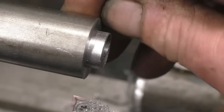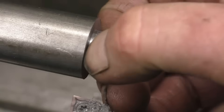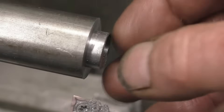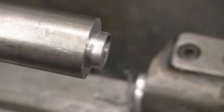So now we've got a nice finish on there and that's down to size. We've machined to the shoulder. Now there is a very very slight radius in there — sometimes you don't want the radius in there, so you put a parting tool in and just take a very light cut with the parting tool to take it out. As I've said, often on shafts you need a radius to give it strength. If you look at a car crankshaft or a steam engine crankshaft, there's a beautiful fillet where the crank web turns into the crank journal, and that's purely to give strength.